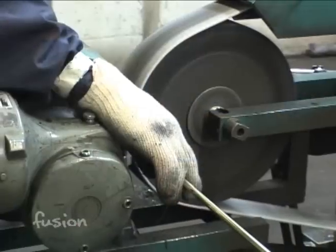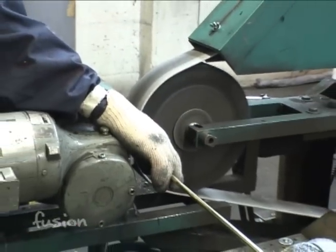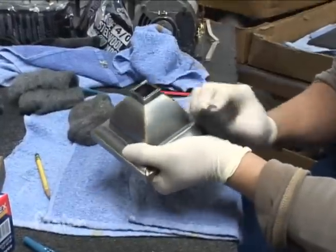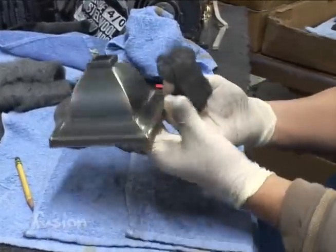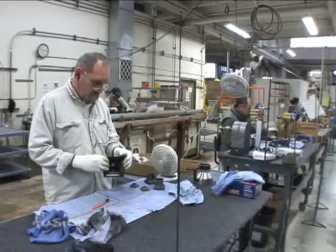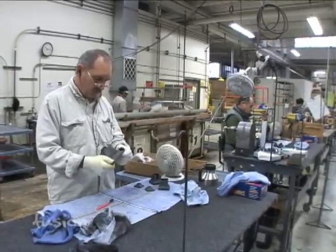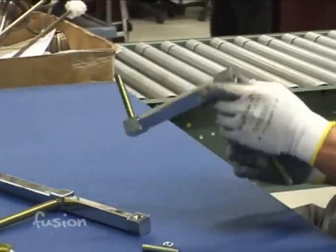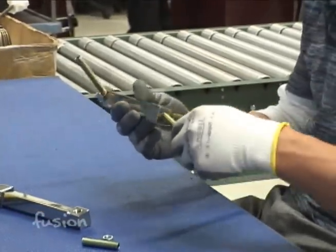Okay, so what types of finishing, and what's the process a little bit? Sure. Everything starts as raw brass, as you mentioned. Sometimes there's a buffing process. There's a sandblasting for our oil rubbed bronze finish. And for our burnished antique finish, there's a lot of hand buffing that happens to get those beautiful highlights on the corners of the pieces. I really noticed there's a lot of attention to detail. I saw signs that actually show what meets standard and what doesn't. Right, it's a fine line.